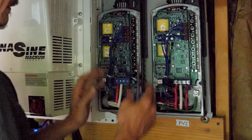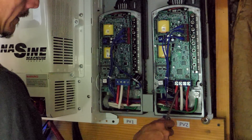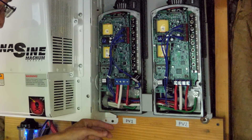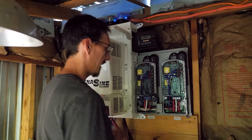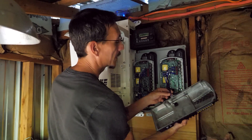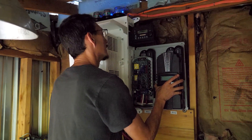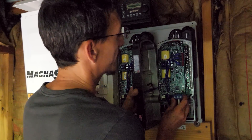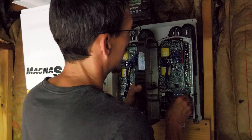Everything is reconnected — it's bolted up, ground is connected, positive from the array is here, negative battery, and all of our Follow Me cables are hooked up. Everything looks good. I'm going to test some voltage and put the fronts back on. I'll plug in this gadget — it's just like an ethernet cable — and make sure you don't pinch it on anything. I'm going to cover these terminal blocks with the blue piece they give you just to make it nice.